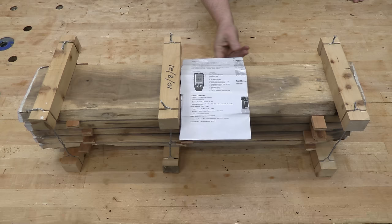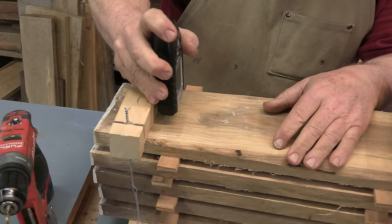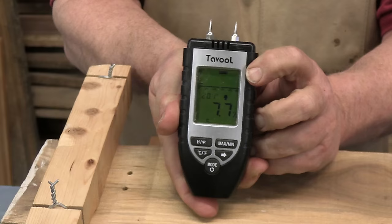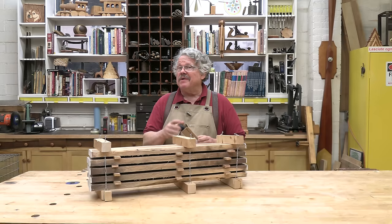The instructions tell you to take a piece of wood from the stack and cut it at least three inches back from the end to expose fresh wood for the test. That's quite a bite when you have a small stack all trussed up in baling wire. So I drilled two holes halfway through the top board a short distance back from the end, inserted the prongs of the meter in the holes, and took a reading. Then I plugged the holes with wax. The moisture content I measured is about what I would expect given the prevailing relative humidity, so I'm going to pronounce this wood air dried — or almost.